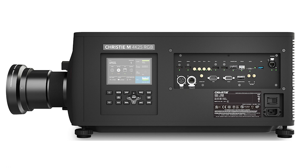Light Lock is our technology that basically synchronizes the RGB colors and maintains them at the same setting from the initial setup. Wherever you set it, Light Lock just maintains that color profile and maintains that stability over time. At lower brightness it maintains that consistently; at higher brightness it will maintain the color. If you're at full brightness, eventually the brightness will come down as the lasers age, or you can run it at a mid-level and maintain that for a much longer period of time, regardless of temperature and other factors. We've also done hardening of the electronics for harsher environments and high humidity environments. Light Lock really gives us that low maintenance opportunity.